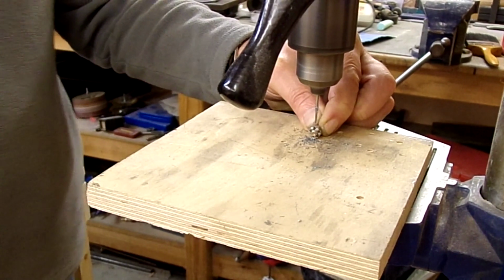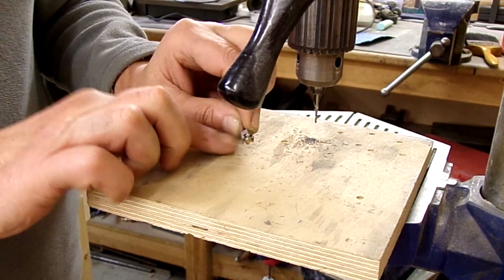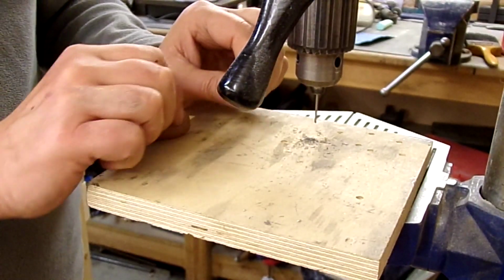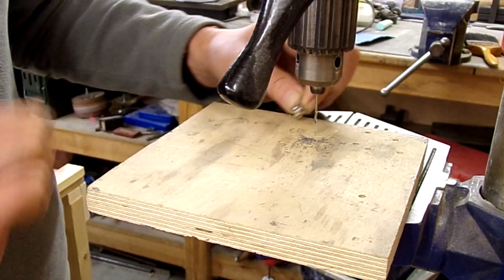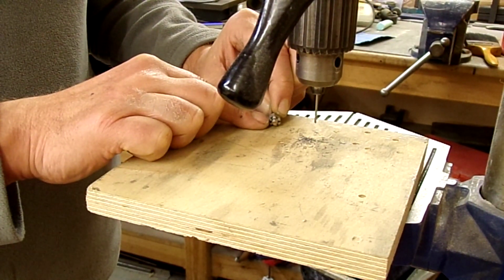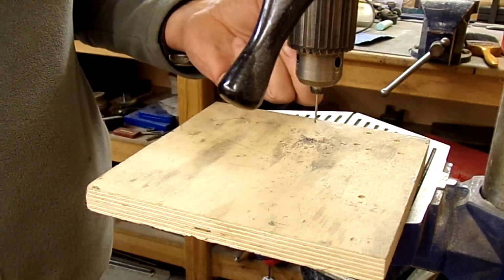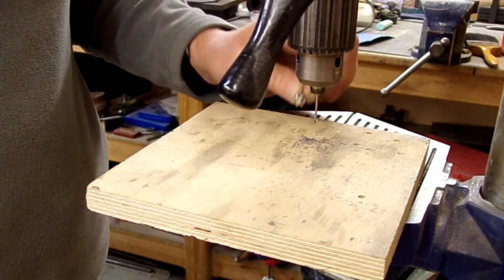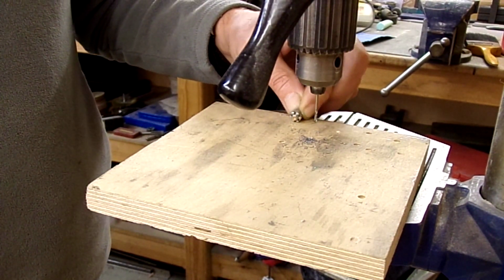As you see, I've just drilled through with this 1.7mm drill, and I used the nut as a guide, but because I put that little start section in, the drill didn't try to wander or do anything mad, and it's come out dead even because I've got that nut there. It allows me to make sure everything's held dead flat.